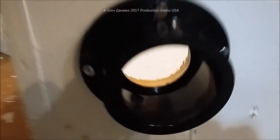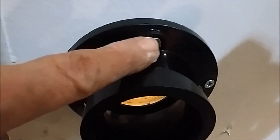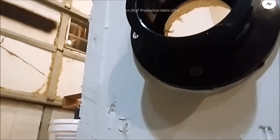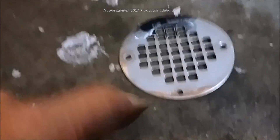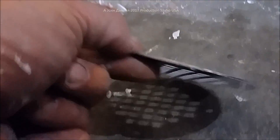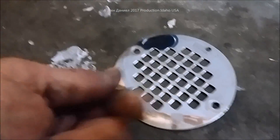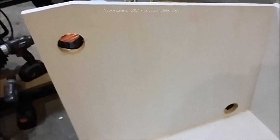Drilling the holes through, I ended up having to use a three-quarter-inch screw here, chamfering the hole for it to seat, and a regular one-inch screw here because of that molded part — putting four of them on there. Then I took the plate, which was originally indented to fit correctly over the top of the shower drain, and now they go in with regular three-quarter-inch pan-head wide screws. That gives you full ventilation for your battery box.